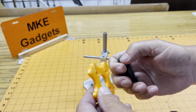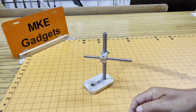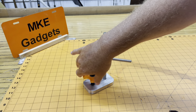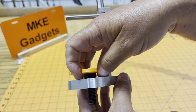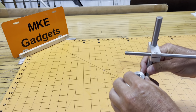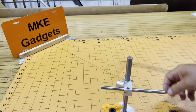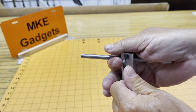So I 3D printed this prototype — this is going to be made out of steel. It just presses on there, so now I can have enough leverage to tighten this down. But I won't have enough room for my fingers in there. So I have this piece of scrap aluminum that's going to be made into a spacer — it's got to be drilled and cut off, and that will fit in here to give my fingers a little bit of clearance. Okay, let's remove this part and put it back into my scrap pile.